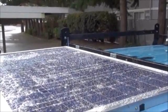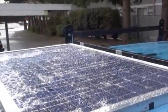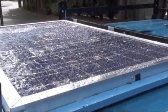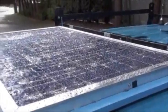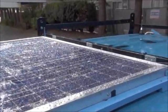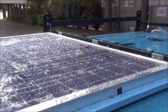It's April 6th, 2011, 2:30 in the afternoon, and I wanted to go over my solar setup, which is pretty much final. Here's the solar panel — 108 watts — puts out 18 volts DC to charge my 12-volt batteries. The maximum amperage for this type of solar panel is going to be about 7 amps.